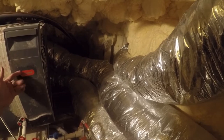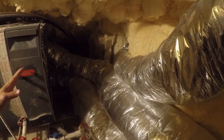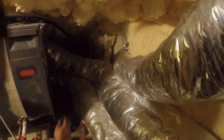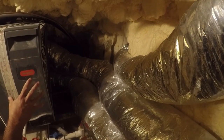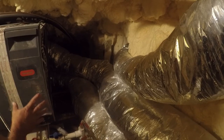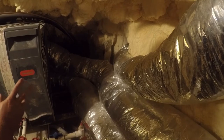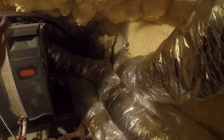One of the reasons I did it this way is I wanted a large cartridge filter for my unit that would provide a decent amount of dust capture and still not be restrictive. It doesn't do you any good to put in an efficient unit and then strangle it with a crappy filter that works more like a blanket.